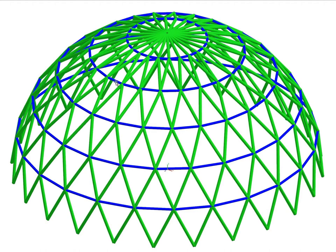So this pattern of maintaining a constant number of subdivisions as we go up, so here we have one and one and one and one and so forth. There's a one-to-one correspondence, so we know the number of straight segments at each of these small circles is identical. That pattern we're calling a lamella pattern, and the definition of lamella is complicated and has numerous historical interpretations. So for the moment, I'm not going to bother defining it in detail, but I'm going to say that this pattern of stacking this triangle on top of that one, on top of that one, getting narrower and narrower as we go up on the dome, we're referring to as a lamella pattern.